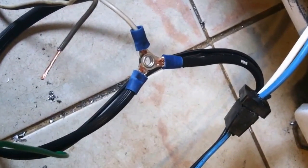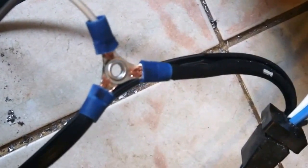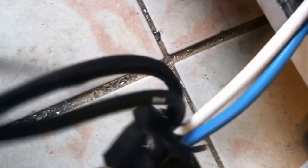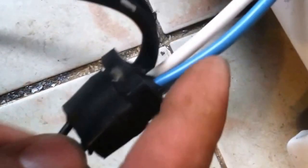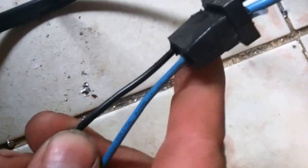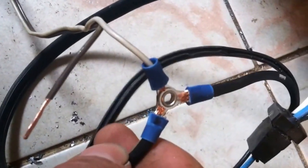I want to show you what I did before I seal this up. This is a tri-connector I got at my local hardware store for 85 cents — I got two of them, one for the neutral side and one for the hot side. I know this is neutral because of that little white dash. Looking at the plug from the side, the neutral goes in next to the white one and the outside is hot. The neutrals inside are connected to each other, and then the two outputs will attach to the sensor wires that went to the old thermostat.